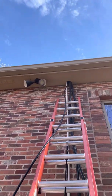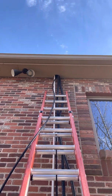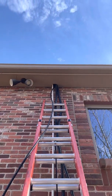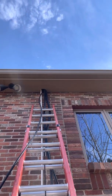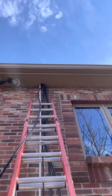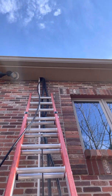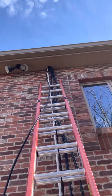So what we did is I glued the PVC pipe. I like to run hard pipe all the way. Some guys use vinyl and that's fine, whatever feels appropriate for you. However, I always like to go to the extreme and do things heavy-duty. PVC pipe is very durable — if you ever needed to blow it out, it's not gonna kink. You're using PVC glue, it's gonna be in there and it's gonna be permanent.